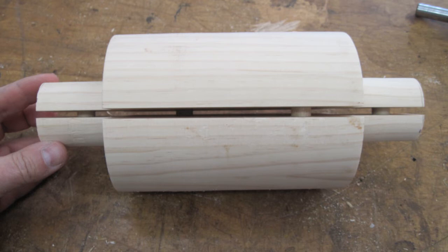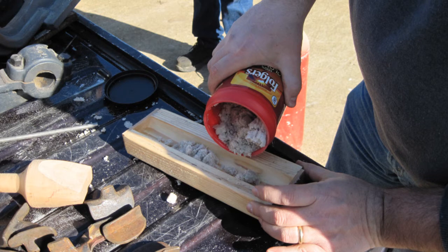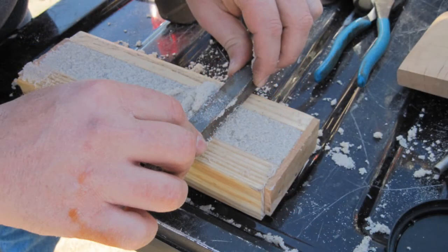I don't have any video of that, but I took several pictures. As you can see, it started out as a split pattern very similar to what we just made. This is the actual core box for that pattern — a lot simpler, just a single shaft going through, made just like we did this one with the core box bit. Here you can see us mixing up sand with some binding agent and packing it into the core box. We ended up with two halves, and here we're just scraping the top off to make it flush.